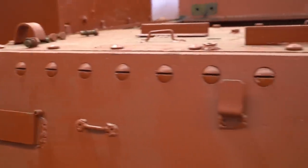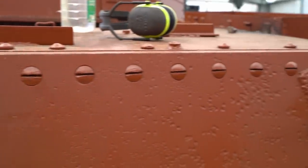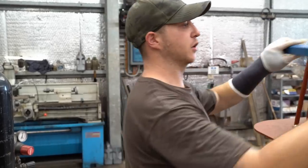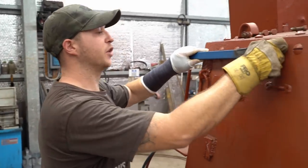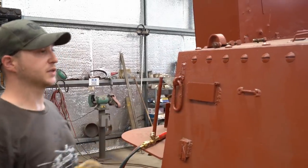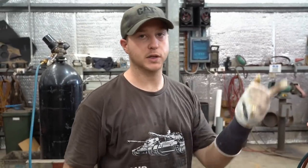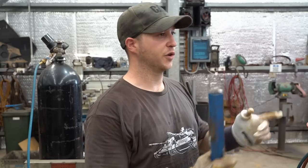These are like slotted bolts. We've made a little slotted tool so we can actually get it in there - it locks it in place and we can try to turn it. I don't know how well it's going to go because they look like they're seized in there pretty good. We're probably going to try heating them up bright red from the inside and do one at a time. We do have a tool coming but we'll try this first - if it works, it works.